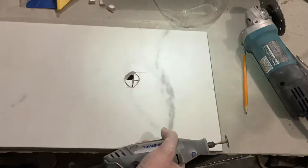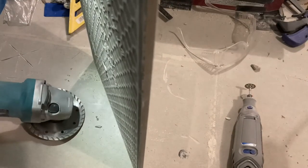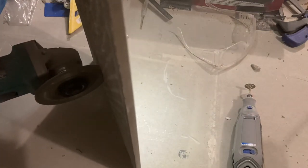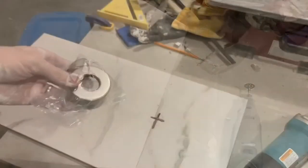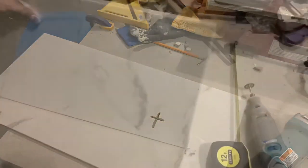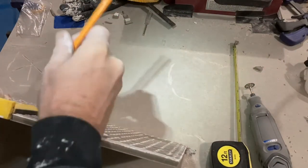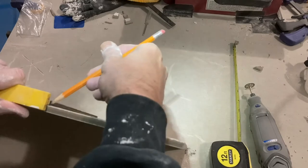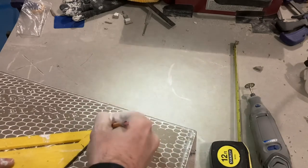You can do that for all four corners. You could also upgrade to the grinder once you have your hole started — something a little more powerful. Hold your tile up on end and go from the back side, looking through to the front. You'll actually see the blade pop through — be careful, it's pretty strong. Do a test cut before committing. Here's me measuring that escutcheon cover just to make sure, and I definitely could have used that measurement, but we'll do another cut here.